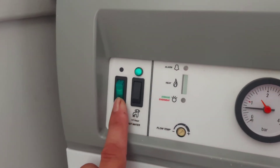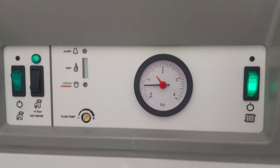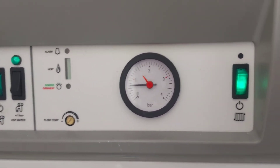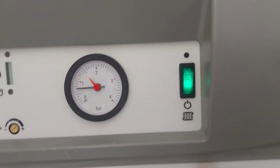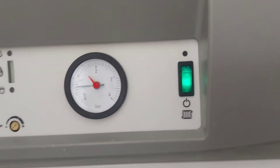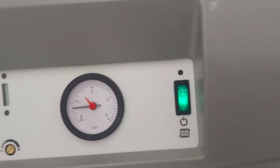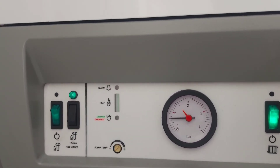Also make sure your hot water button is turned on. That's your water pressure valve - 1.5 bar, just right. And this here is your radiators. There will be a programmer and a thermostat connected to this where you can set up your 16 degree base temperature and then turn it up and down as you wish. This dial here gives you a demand for heat or not.